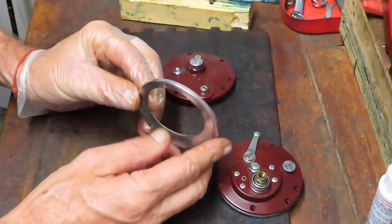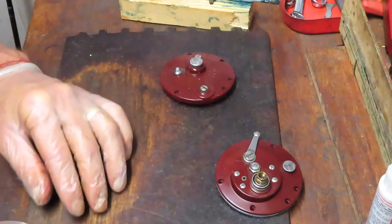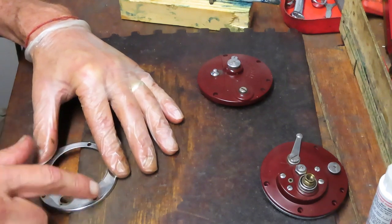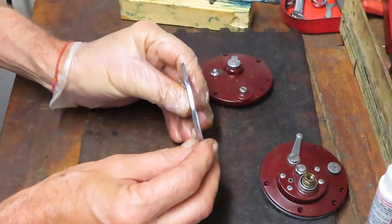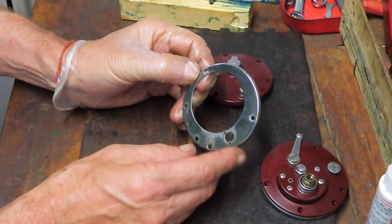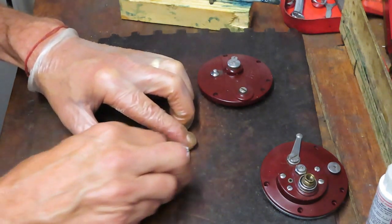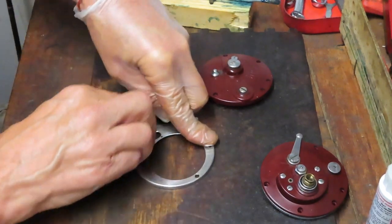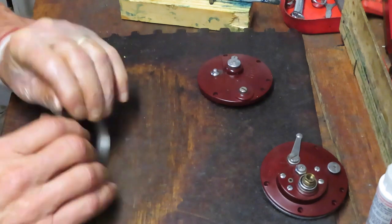We have a minor bend — it's not much, but what I like to do is just reverse the bend. I try to find the fulcrum where it bent, which was these two eyelets, and just press gently using hand strength. You can usually get it close enough without going crazy. I've seen people bang it with hammers or put boards on it, and they only wind up in worse shape and need a new trim ring. Just a little bit of opposing force from the way it fell, and we'll clean it up since we have it off the reel.